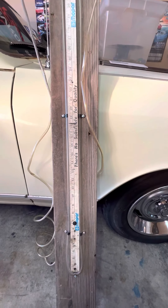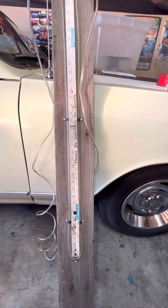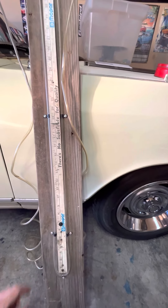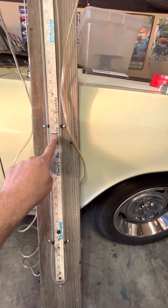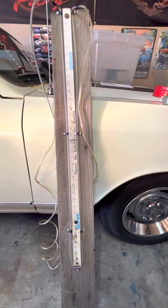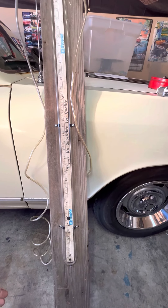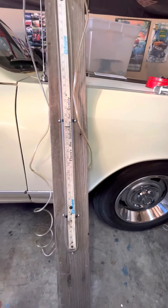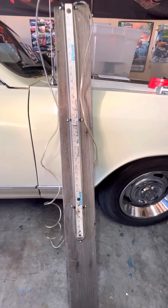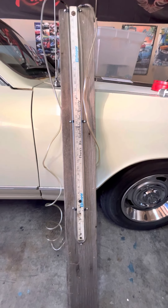As you can see, the last time I balanced my throttle bodies with this homemade one, I took a little marker and just put a mark where my channels were leveled out. When you balance your throttle bodies, you're going to do one throttle body at a time. You always start with the driver's side — the rear throttle body.